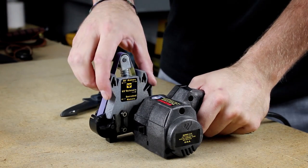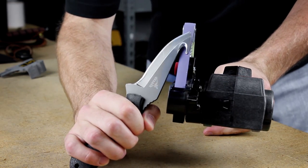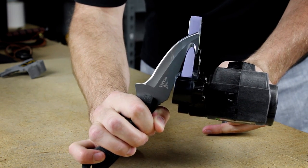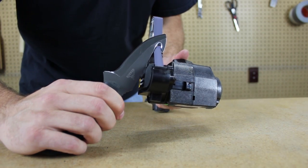To sharpen the gut hook, remove your sharpening guide. Place the gut hook onto the 6000 grit belt so that it flexes inside of the gut hook. Apply a little bit of pressure so that the belt deflects out of the gut hook.